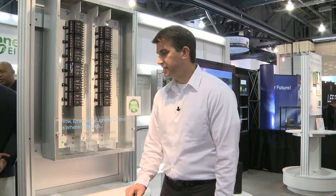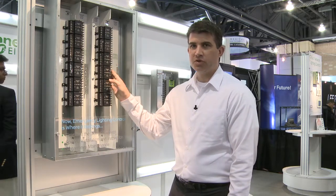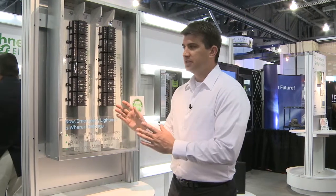Today, I'd like to introduce to you the Emergency Lighting Control Panel Board. What this device is, is it's a factory-assembled product consisting of our automatic load control relays, as identified in NEC article 700.24. What this allows a facility to do is, if they have a centralized emergency backup system, they can use these devices to help illuminate their egress paths.